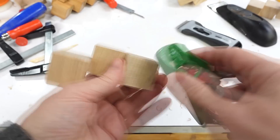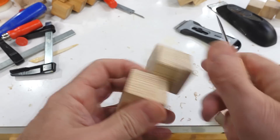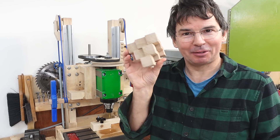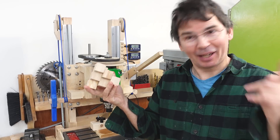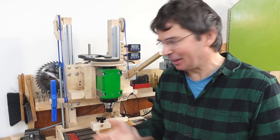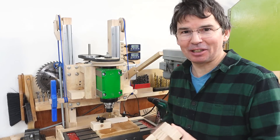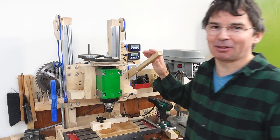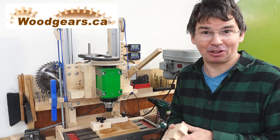Chamfering the edges with a palm plane and a carving knife — no slower than the belt sander, and no burning this time. Every time I've shown this puzzle to a friend, it made them feel stupid, as it did me the first time I saw it, because it's just three pieces — how hard can it be? The motivation for this video is I had to glue the other one back together again, and I thought I could use this machine to do some precision doweling and that would be a cool thing to show off my machine for. It's kind of a failure as a milling machine, but as a precision drilling machine — it's awesome. To be continued...